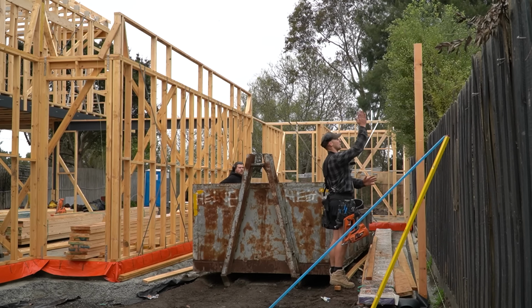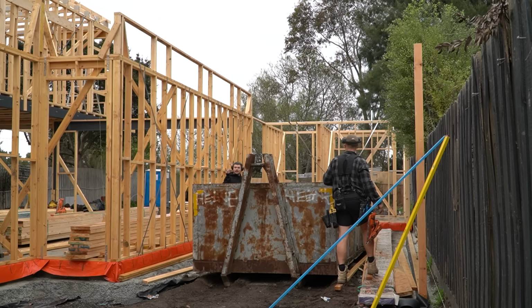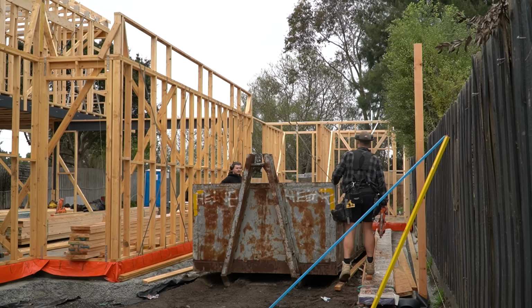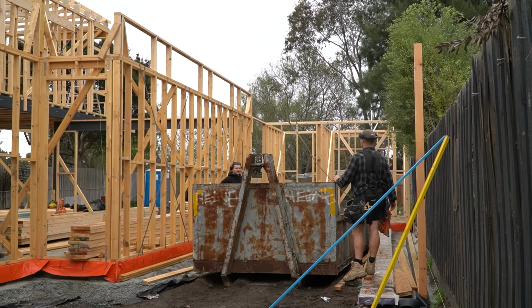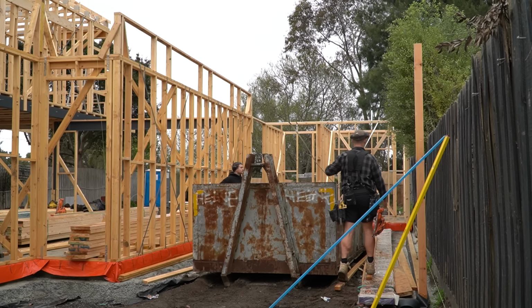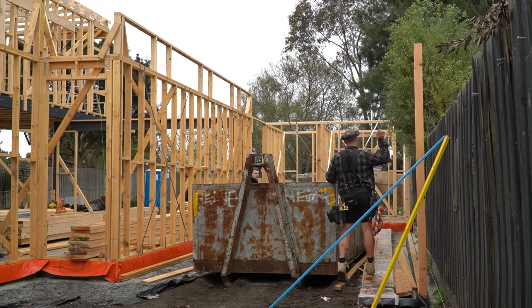We'll just get a temp brace, we'll plumb that up so it's solid. And then I'm thinking, temporary, like in this way first, yep. And we'll do that way as well in a second. I'm hoping with this weather, I might get my green line laser level set up, but I just want to make sure that these heights are pretty similar. I've got no idea what this pad's poured like. If they're within 3 mil, we'll just cut them all the same. If they're not within 3 mil, we'll get this one right, and I think...